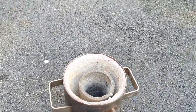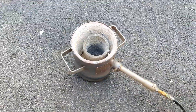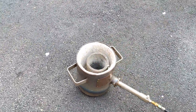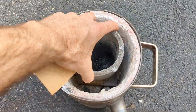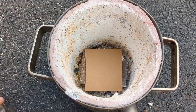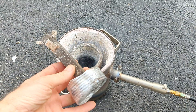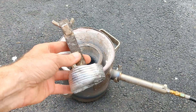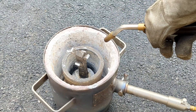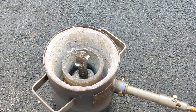Now I need to melt the metal. I'm going to use my Castmaster Light GG-5000 to melt the molten aluminum. I'll use a piece of cardboard between the plinth block and the crucible — this helps prevent the crucible from sticking to the block when you remove it. For the aluminum, I'm melting down a cutoff from a past lost foam casting I did — the Green Lantern Corps coins from about three weeks ago.